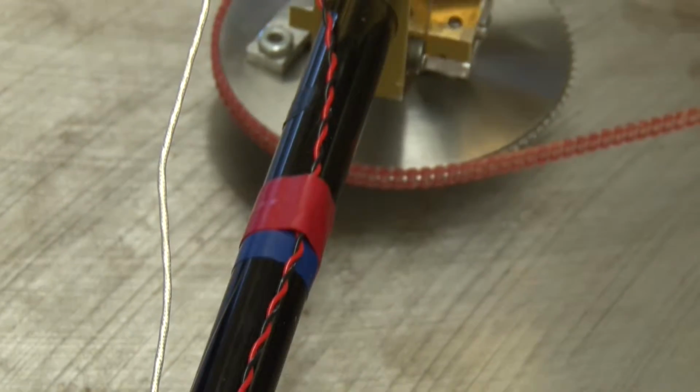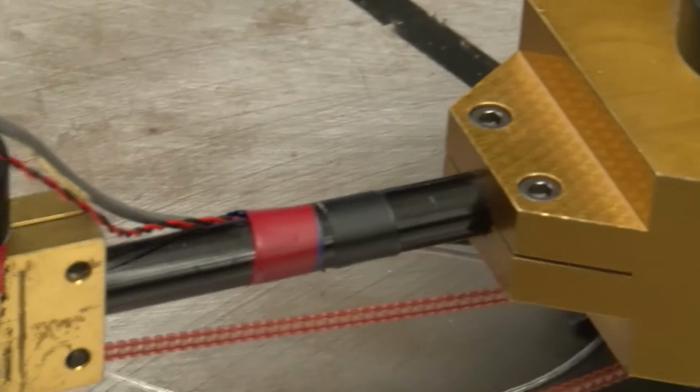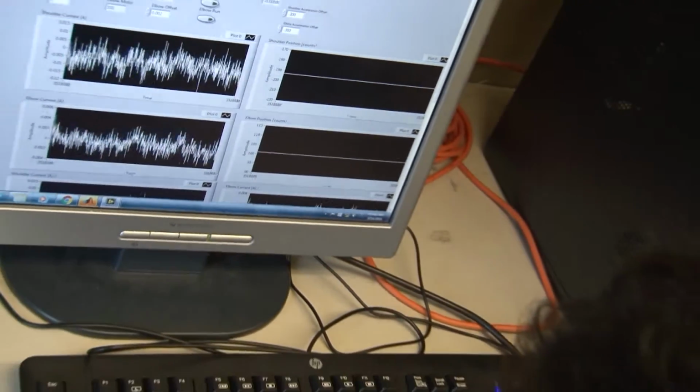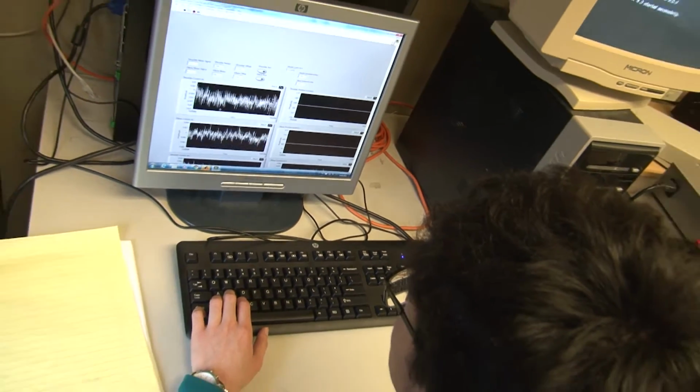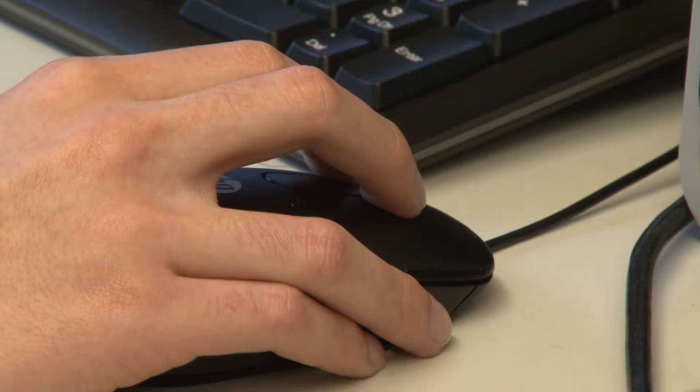The two-link arm that I have here in the lab is a classic example of a system that's a little bit harder to control. If I move the arm from one point to another, the arm gets longer. That means the inertia element gets longer, even though the spring stiffness stays the same. So that means that essentially I change the frequency. And I change it not every once in a while, but I change it throughout the motion. And so what we're trying to do here is look at new strategies that will allow us to minimize the vibration, even for systems for which the vibrations are changing.